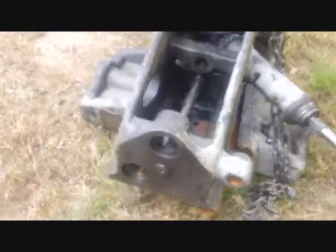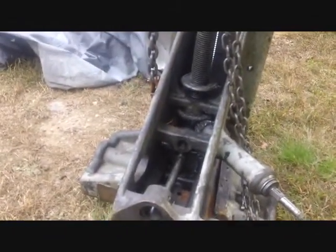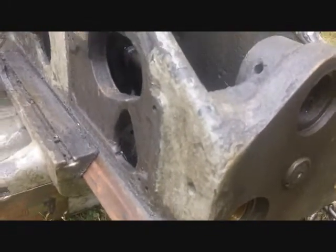It's the next day and I'm back to working on this assembly. I got some good information from a gentleman named Reed, one of the people interested in buying some of the parts. He gave me the trick to removing the shaft — deep in this hole on the side is a very long set screw. I've got the set screw loosened. There's also a little allen set screw that I loosened to move this gear up so the shaft can come out. I gently tapped on the end of the rod with a drift and was able to push this bushing out.